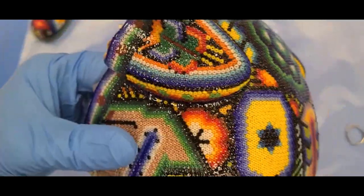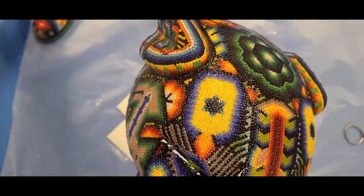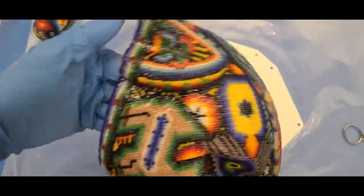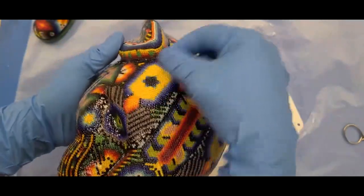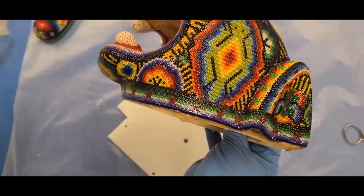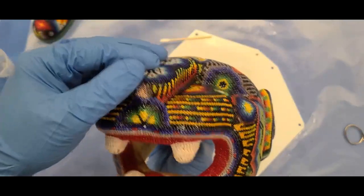I think I did make one mistake: I didn't make enough epoxy. By the time I was running out, it started to get really thick and goopy, and I don't think that was for the best. What I should have done is made about a third or 50% more, and just slopped it all on as quickly as possible while it was the runniest it could be, so it would have gotten between the beads and then I could have painted it out over the rest. By the end, it was so thick it was actually hard to get it out of the container and push it between the beads. I'd recommend using a bit more and slopping it on while it's as thin as possible directly after mixing, because it's really going to thicken up on you.